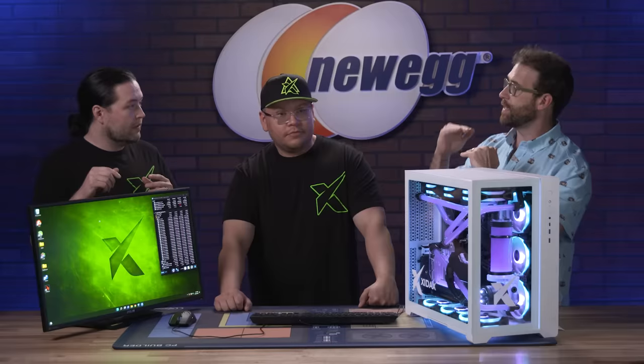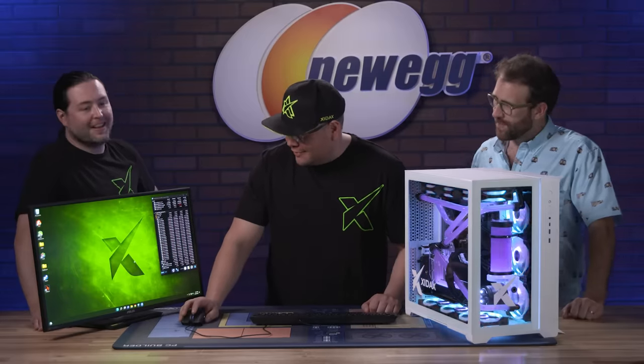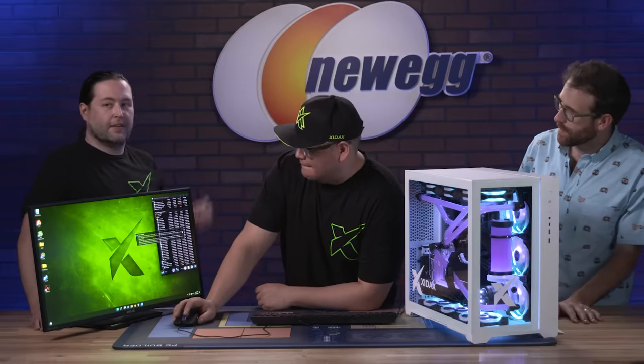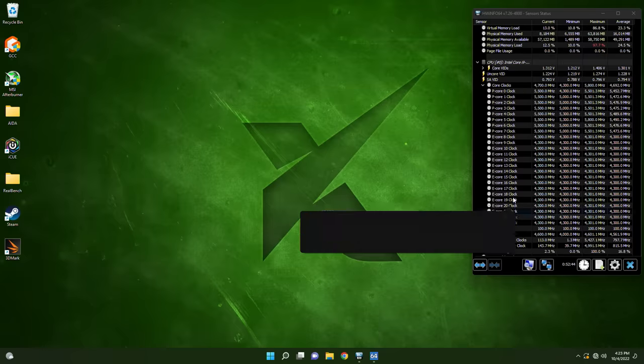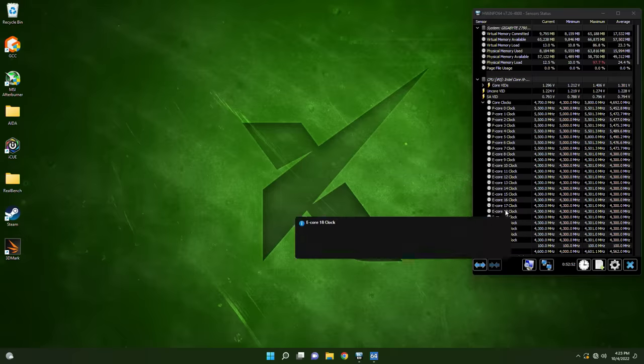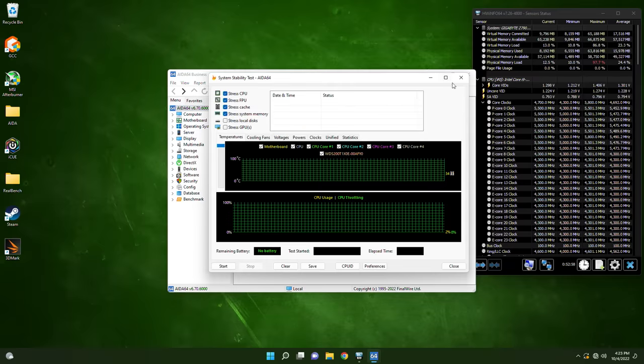So if people were overclocking at home, you tell them to start where you can and then step it up. I'll make it pretty simple — I won't change too many settings that you won't have to at home. We're just going to go for pure CPU performance, so anybody at home can do it. We'll use HWInfo, which gives us information on the CPU cores — both P and E core — along with voltage and all that other stuff, but we're just going to focus on core clocking.